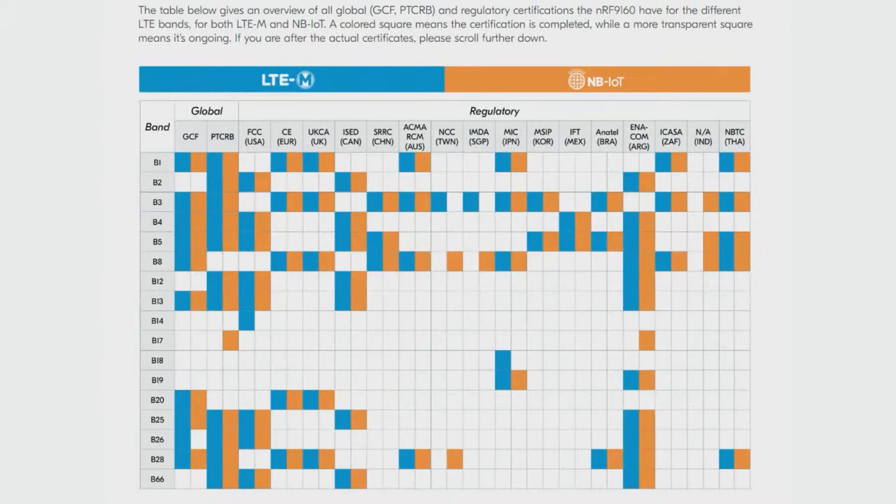What I thought was neat is all the modules have 700 MHz to around 2-point-something GHz bandwidth, which means there's no regional locking. One thing I've noticed with cellular modules is there's a North America version, a Europe version, an Africa version, South America, Australia — it's very zoned based on frequency. But because these are all wide-band, you can use any of them in any zone that has frequency support. They also have regulatory certifications like PTCRB, FCC, CE, etc. There's a certifications page where you can check that the country you're using it in is pre-certified for your band, so when you go for final product certification you can skip a couple of steps.